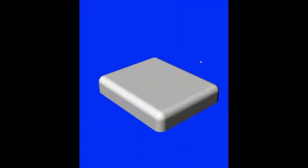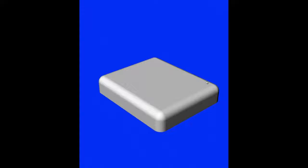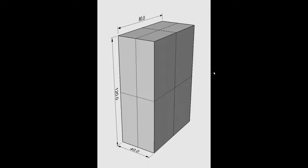However, when you come to a piece like this, it looks fine from the outside. It looks fine, and you have all these corners. This is slightly better, the corners are better. The only thing is, if you want to actually make something which has fully rounded corners like this, you have to make special deep drawing tools. Deep drawing tools are costly, compared to the thickness of the material, to make it like a tube.